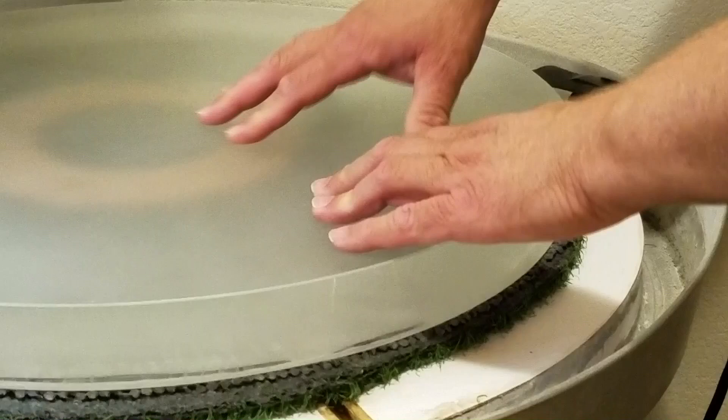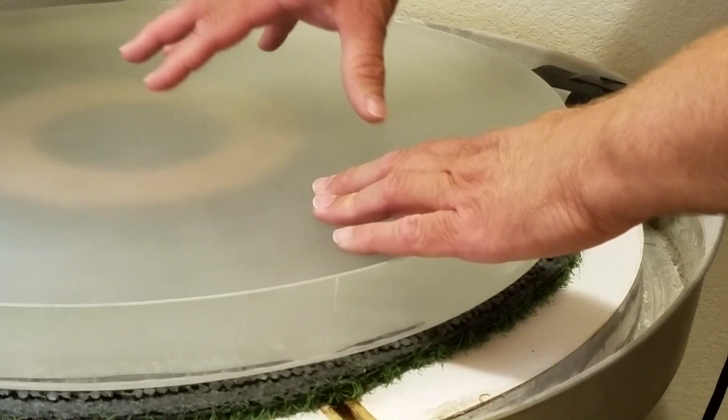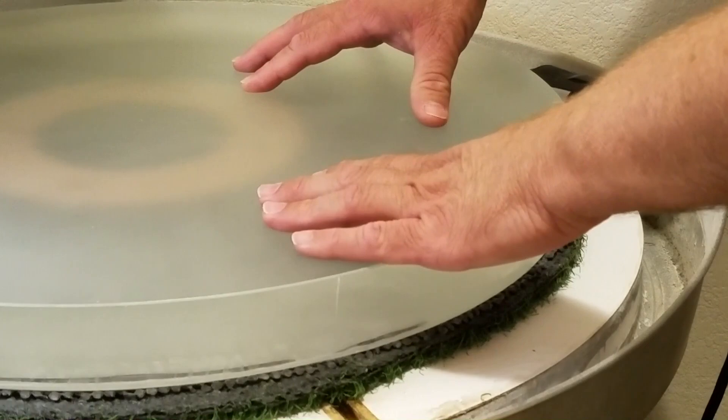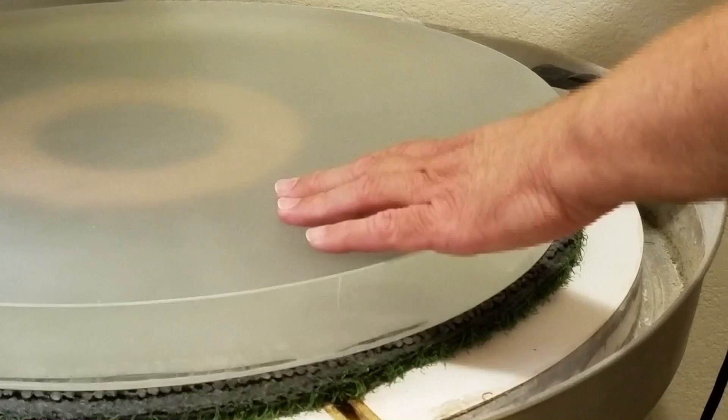The reason we have them molded is that the front is so deep at f3.3 that it's actually cheaper to build a mold and then pour molten borosilicate glass in there than to fabricate them the usual way, which is to just cut a circle out of a sheet of borosilicate. The glass saved from the curve can be reclaimed, and if you pour a certain number of these you essentially get a free blank.